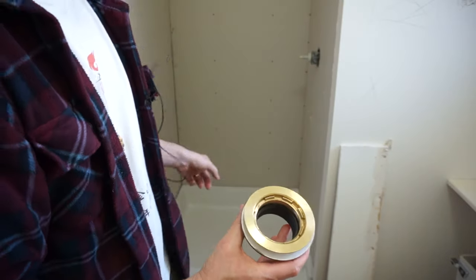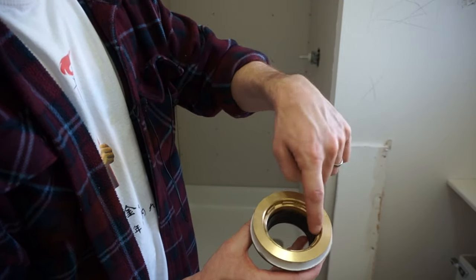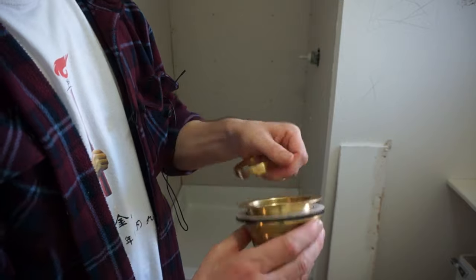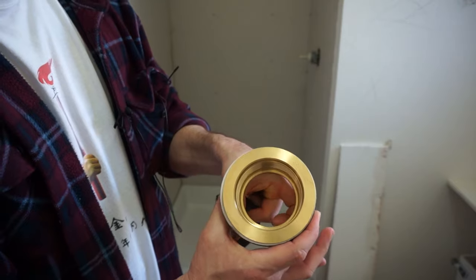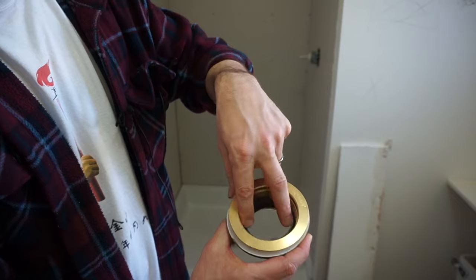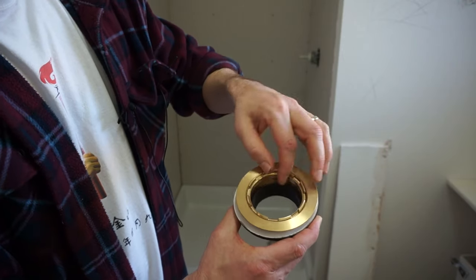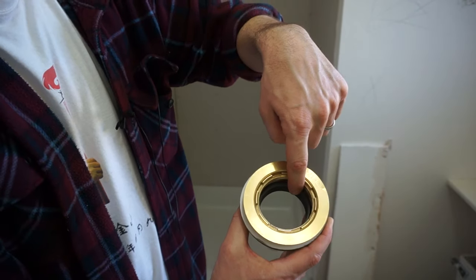If you look into your shower and you see this little crown nut, you need to unscrew that and get it out of there. Then there will be a gasket. This is a no-caulk shower drain — you put this in over your pipe, whether it's PVC or cast iron, and then this gasket drops in around the outside of your pipe. Then you drop in this crown nut, it spins down and compresses this washer onto your pipe.